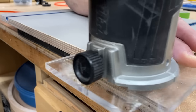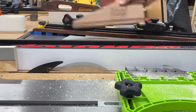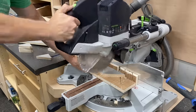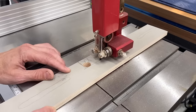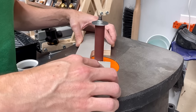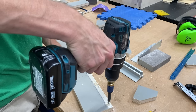Next I needed to get to work on the actual fences for these router tables. To accommodate the mounting of the fence adapter T-track, I'm cutting a little rebate in the back of the bottom fence. Then over to the miter saw to cut my angled support blocks to keep the fence square. To rough out the access slots in the back of the fence and the bottom for dust collection and bit clearance, I'm at the drill press with a Forstner bit to clear most of the waste, then over to the band saw to clean up to the lines, and then the spindle sander to smooth everything out. Since this plywood is pre-finished I'm roughing up the surface a little before gluing the two pieces together to ensure glue adhesion.